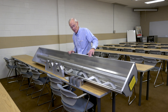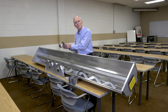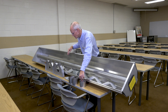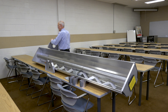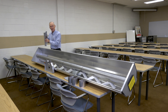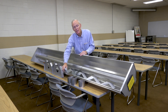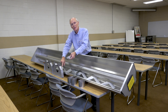Now some of the other things that come into play in this reflector kit are the tube couplers. This fits right onto the end of the tube. And if you have 40 feet of tube, you've got three couplers — it just screws down with the bolts like this. These are the end caps. This kind of fits on the end here. You put this on here between each of the reflectors, and that kind of stiffens it up and it connects all the reflectors. Plus the last piece is the hooks and the sheet metal screws. The hooks go right on here and the sheet metal screws go right in here to connect everything.